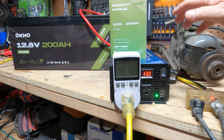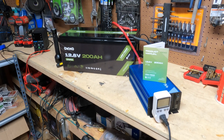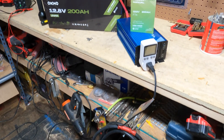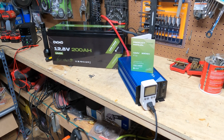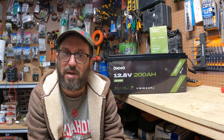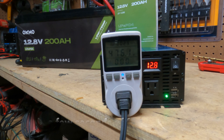I think I'm hitting the limitations of my inverter. So far, the battery has not given me any overcurrent shutdown. That's about all we can do with all of this, but the battery was able to put out a fair amount of current. For the final test, I'm going to hook it up to my space heater for a long-term capacity test. I'm going to put the camera on time-lapse and watch it go. I set my camera to time-lapse, but about a half hour into it the battery on my camera dies, so I only get a few minutes of footage.